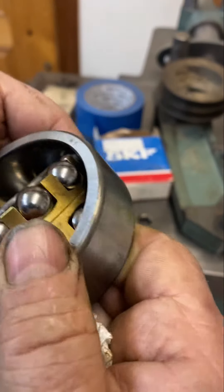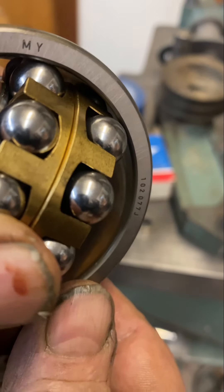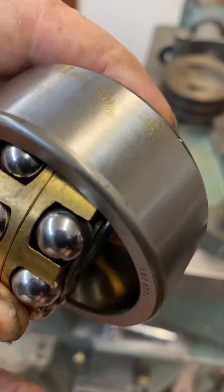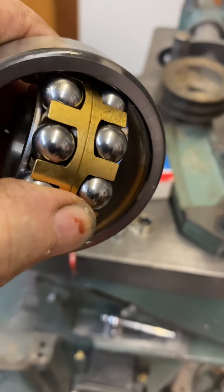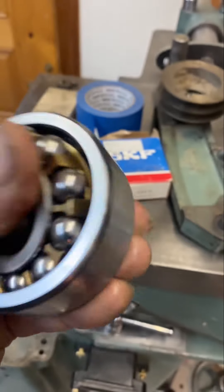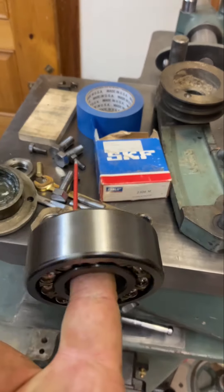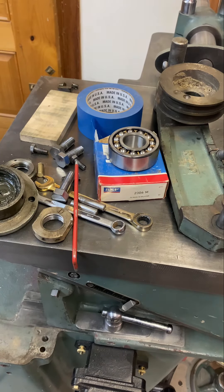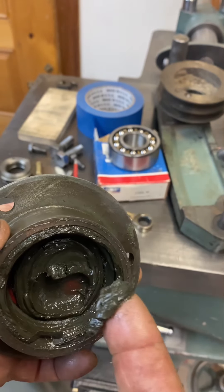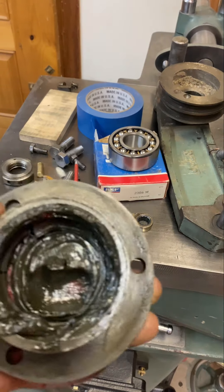On our new bearing, there are no marks on the inner raceway — it's perfectly smooth, just absolutely perfect. That is how you tell if you've got a bad bearing. Probably what happened is someone pumped the old bearings full of grease, ran the machine, it sounded good, then once the grease moved out of the way it started making noise again. This grease looks like ball joint grease — very hard and waxy. That's not actually that bad; I've seen stuff you could carve your initials into.